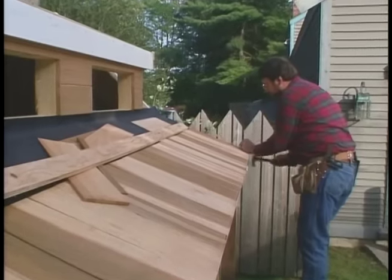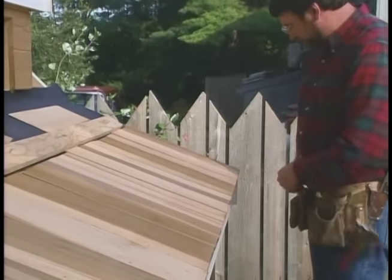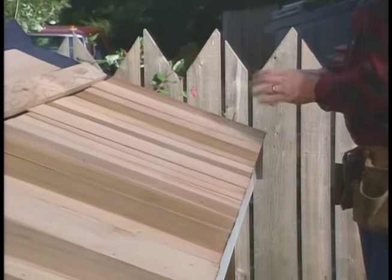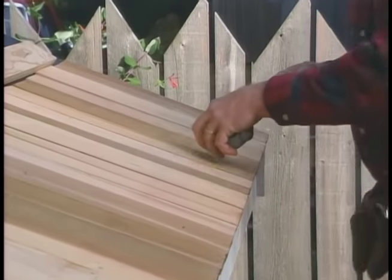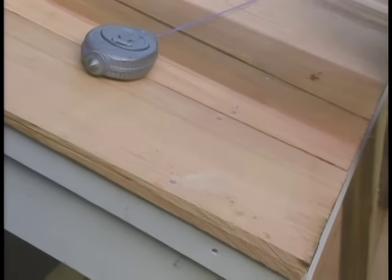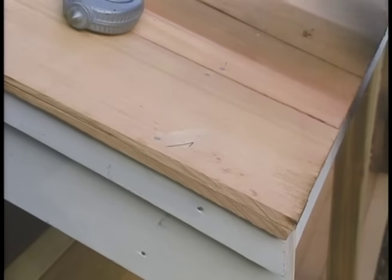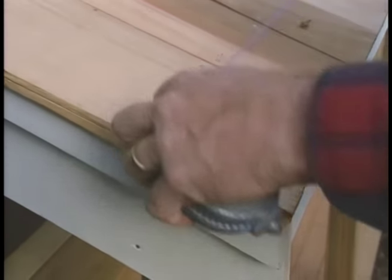For the second course, I'm going to tack a nail here 4 inches up from the bottom edge of the shingles so I can hook my chalk line on. Bring it down the other end. Mark my exposure again at 4 inches. And snap a line,